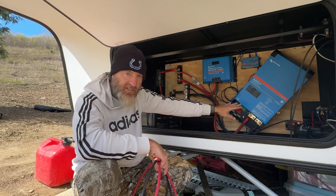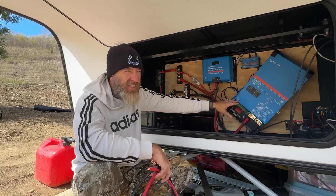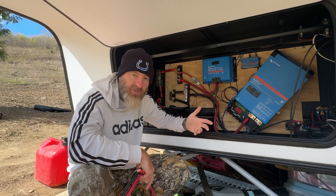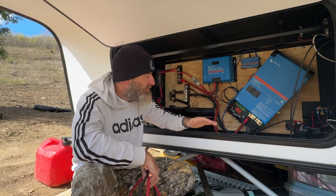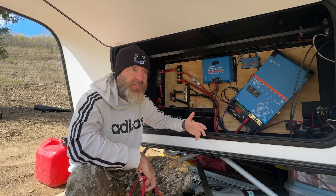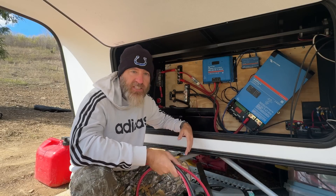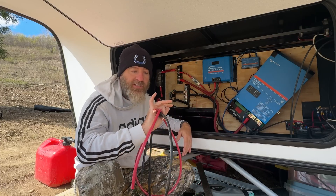Victron says to use 6-2 wire for this, which is way overkill. I believe this is a 50-amp inverter with a 70-amp surge capacity. It's a 30-amp camper so we're not going to be anywhere near that, but I'm going to run the 6-2 wire anyway - overkill yes, a little more expensive and a pain to work with, but then I can upgrade later if I need to. If I wanted to make this a 50-amp setup down the road I'd be set up for it. Future-proof. I've got ends on one of these, just need to crimp ends on the other.